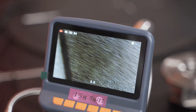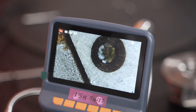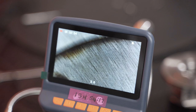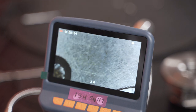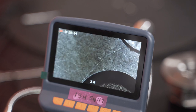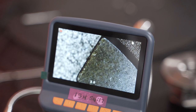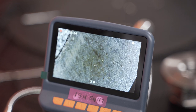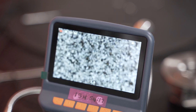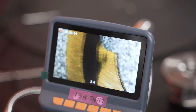This specific method is ground. That's the oil hole on the second thrust face. There's the third one as I'm turning this around. So it's not machined. I'm going to turn this over. You'll see other grooves. That's the oil groove. There's one of the pads, the thrust pads. There's the other one. No machining marks, no striations. The same thing goes for the thrust bearing that we were analyzing.